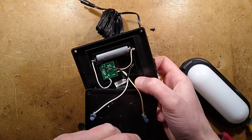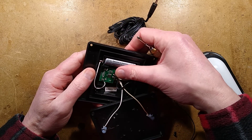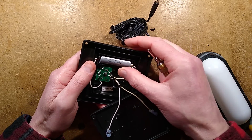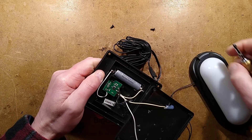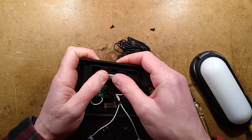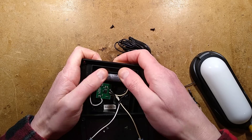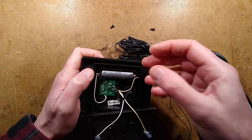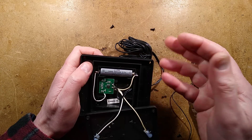There is the lithium cell. Battery must be recycled or disposed of properly - you don't just throw it in the bin. Date code 15 for 2022, which is pretty good. Let's see if we can get it out. Smart Solar lithium, 500 milliamp. It's a 14500, which is the size - 14 millimetres diameter by 50 millimetres long and 3.7 volts.